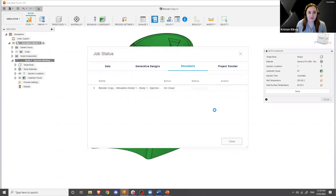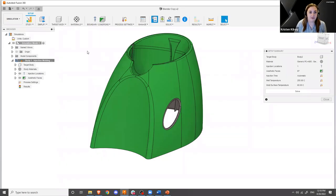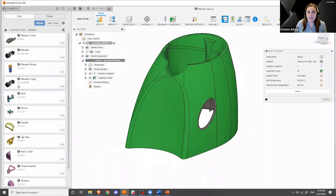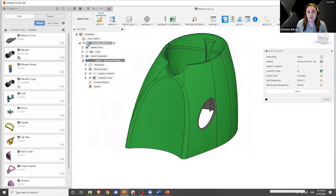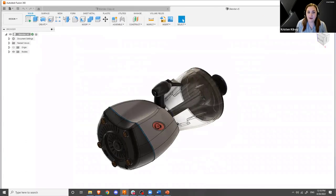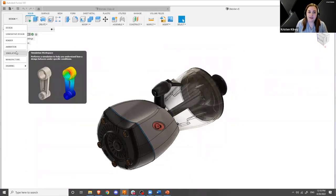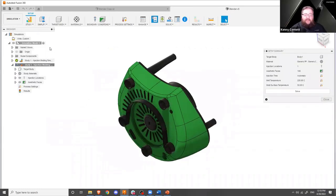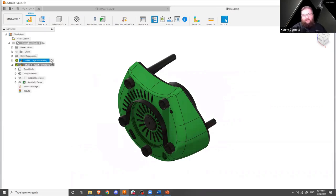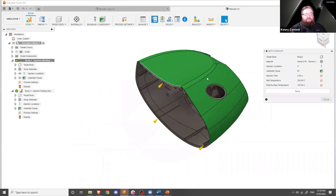While loading, there was a great question that came in about the actual CAD models. The CAD models don't necessarily have to originate from Fusion — all you do is import your third-party CAD model into Fusion and then initiate the simulation from there. They do have to be a solid — you can't run meshes at this time. So STEP, IGES, SAT files, anything from SolidWorks or CATIA or any of our AnyCAD workflows should all work just fine, so long as they're a BREP in nature.